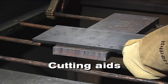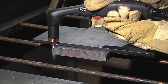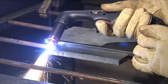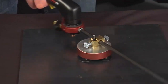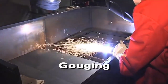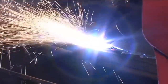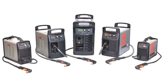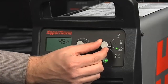To get better cuts, a variety of tools can be used. For example, I can use a straight edge such as another piece of metal or angle iron for a straight or bevel cut. For perfect circles, Hypertherm offers an optional circle cutting guide. There are many jobs where someone might want to remove a weld, make a groove in the metal for welding preparation, or simply remove unwanted metal. Plasma gouging is perfect for these jobs. The PowerMax 45, 65, 85, and 105 have an operation mode and consumables specifically for gouging.